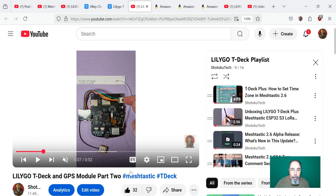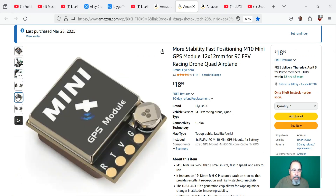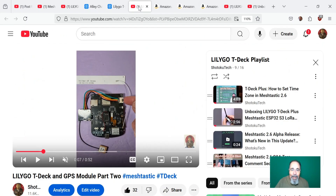I made this video, 'LilyGo T-Deck and GPS Module Part 2' — it's a short video that demonstrates you can solder the leads for your GPS module to the pads for the Grove connector. It essentially takes up your Grove connector and uses it for the GPS. Make sure you have a good soldering iron when doing that, because those pads are real close together. I did manage to do it — I'm going to solder leads on both the GPS module and to the Grove connector pads in order to make the TTGO T-Deck like the T-Deck+.